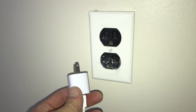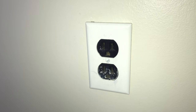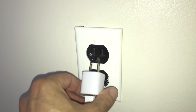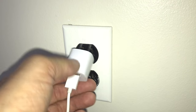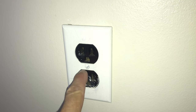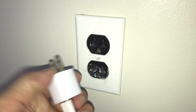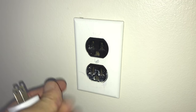I have here this almost 50 year old outlet, and whenever I'm trying to use it — for example to charge my phone — my charging cube just falls out. It's not holding in either of the two outlets. That happens because the springs inside the outlet that are supposed to hold the plugs in securely just wear out over time. So 50 years later, this is just not going to hold on anymore.